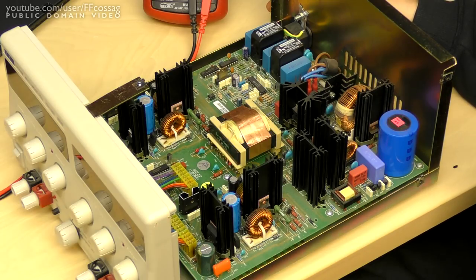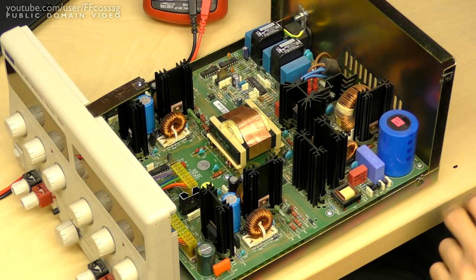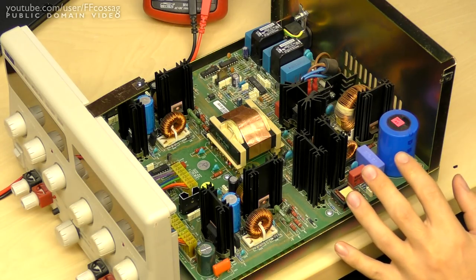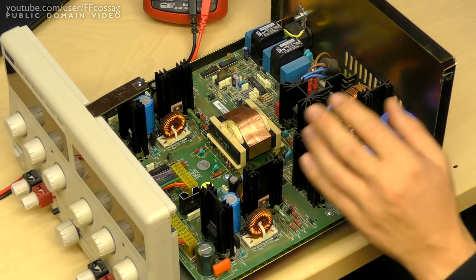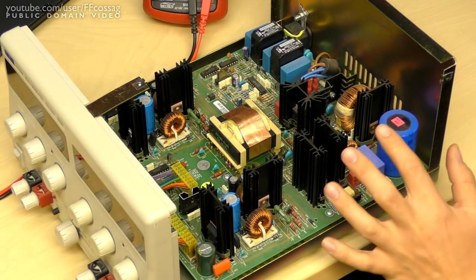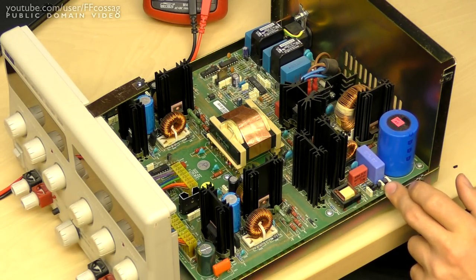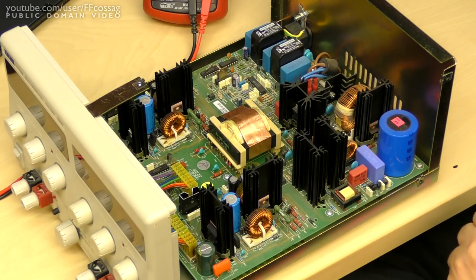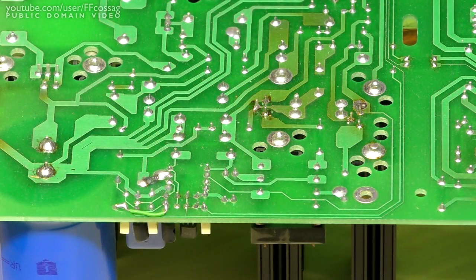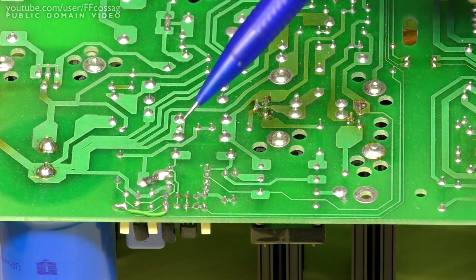Gonna have to just measure around, check the schematic, see which parts are broken. It's probably gonna be a shit ton, and it could also be caused by an issue on the secondary, since it's supposed to be primary side current limited according to the service manual, but I'm not sure if that actually works or if that just causes the PFC circuit to blow up. Alright, so I got the PCB up, and we're looking at the area around the exploded transistor, it's right there. But look at that!